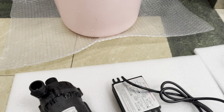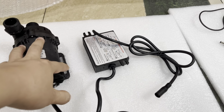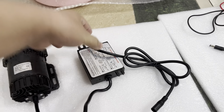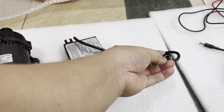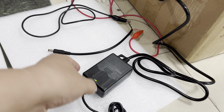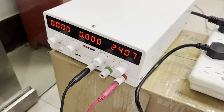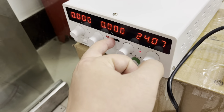Let's talk about the simple water pumping test bench in this video. This is the pump as a whole: the pump body parts, the control box parts, the piping part of the whole pumping system. The installation in the system — this part is recommended to be placed at a somewhat dry and lower temperature location. This is the power connector, DC, inside positive outside negative, DC 24 volts. This is the bucket of water for the water pumping test. Here is the obviously less powerful power supply for the abnormal test, and then we will use another power supply to indicate the real parameters of this pump — with voltage display, current display, and power consumption display.